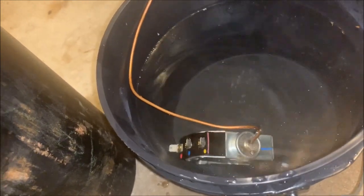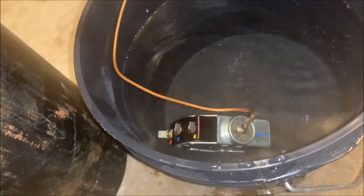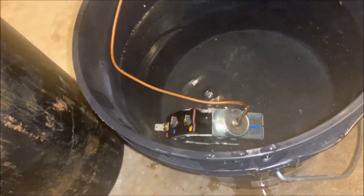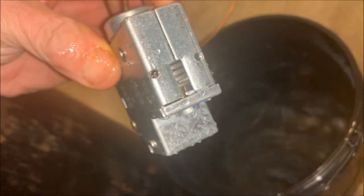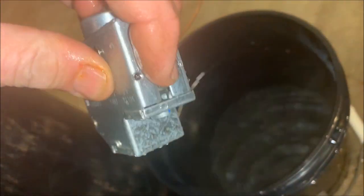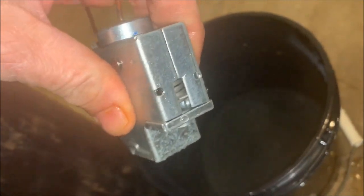It's one of those things where you get there and you don't see anything, you can't find anything. You've got to think about what normal operating condition the unit is in. The other thing that made me think it was a low pressure leak was that you've got an adjustable bellows on this thing. I took my screwdriver and moved it around a little bit and I felt the refrigerant get cold in my hands, so I knew refrigerant was leaking out.